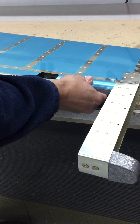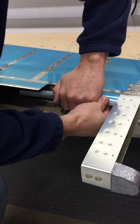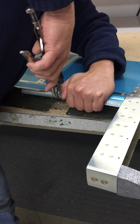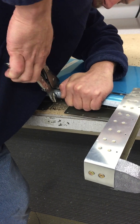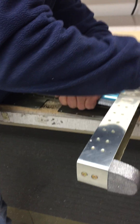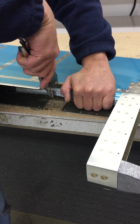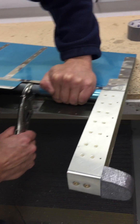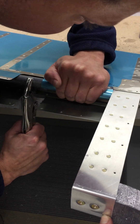Ideally, I want this three-quarter inch bar to bottom out on the spar, and that's going to force this curve as far back as I can. With Vans, they tell you the inch and a half and inch and a quarter, so you can't always get the curve as far back — that's why you do it half the diameter. Bottom down on the spar.